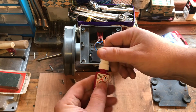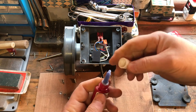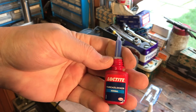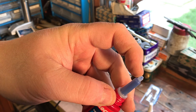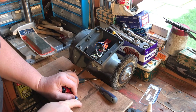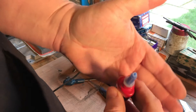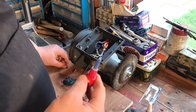So, thread lock — normal strength, blue. When you take the end off, just take a little Stanley knife and chop the very end of this off, and you'll open it up. Give it a thorough shake before use. Don't allow the tip, if you can, to come in contact with what you're applying it to.